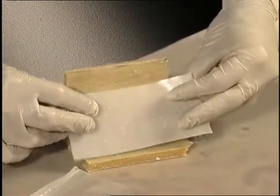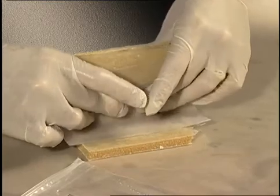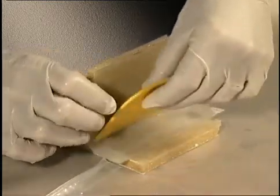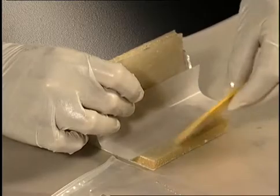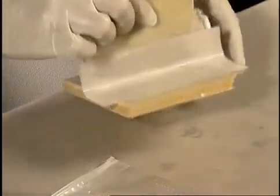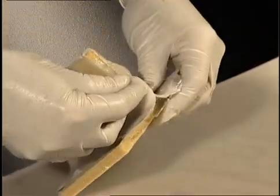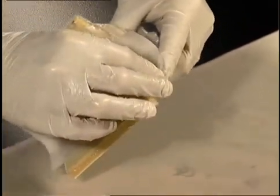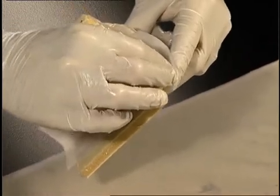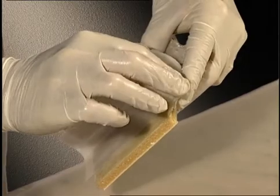You can see this whole process — it's a very clean, neat process. We'll lay it up on our joint and use our squeegee to smooth it out and get rid of any air bubbles. In this particular layup I have two layers of glass laid up all at one time. Next step is to take the second piece of plastic and peel it off the glass.